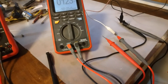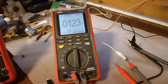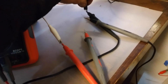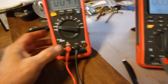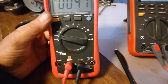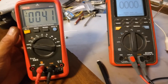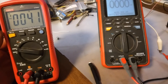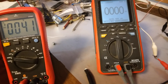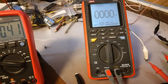Now this is all three of them tied together: 12.3 microamps. And checking the voltage: 41 volts. So the voltage goes up a little bit when they're all tied together — individually they're all about 36 volts — and the current went up some too. I think it was 9.9 microamps with the first two tied together, and it went up a little bit more with the third one.